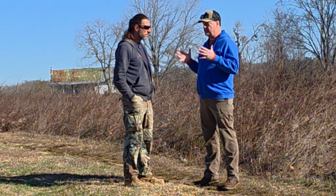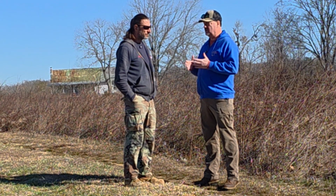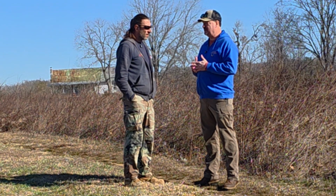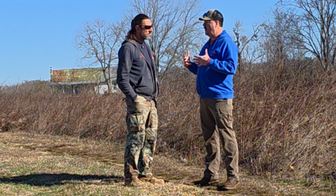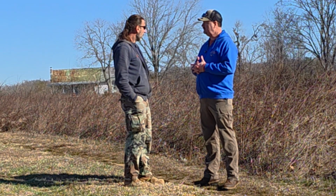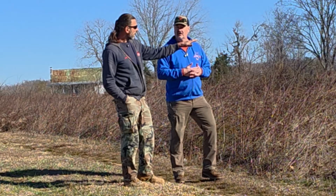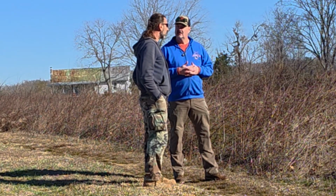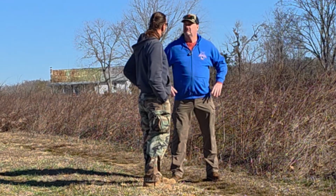And we're purchasing a lumber kit from a local source. Yep, keep our money local. But what are some of the steps that we're looking to do overall for the project? Well, step one is going to be to clear off some of this brush and bramble and get the house site scraped down. Get the topsoil pushed back and get us a nice flat pad to start with.